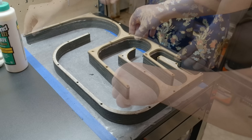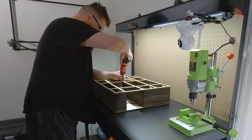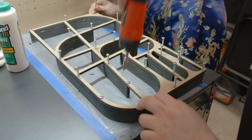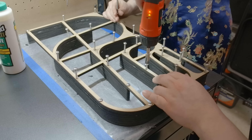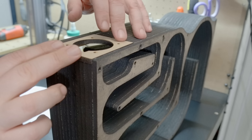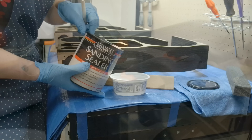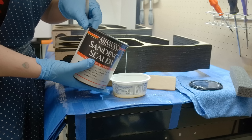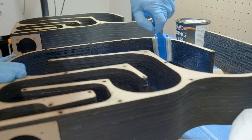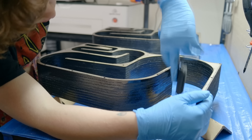Let's get everything put together. I'm using the same type of alignment grid as I did for the tapped horn project a few months back, this time with a total of 26 screws providing both the temporary clamping force and the alignment from one layer to the next. Everything fit together perfectly, and with all the MDF pieces glued, the entire thing is coated with a few layers of sanding sealer — for this project I'm only looking to encase the material in polyurethane.